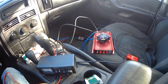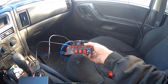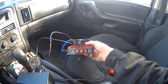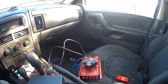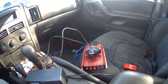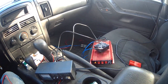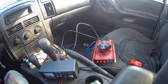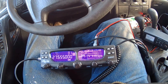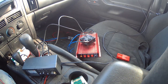This is a BJ 300 Plus — the Plus is the fan — and this linear is 300 watts. It cost me $89 plus tax with free shipping on eBay. Linears are pretty cheap now, and this is a super popular one. Texas Stars, Palomars, Messengers — those linears are really hard to get hold of new nowadays, and a lot of the used ones have issues and aren't working well. I just prefer to buy new stuff.